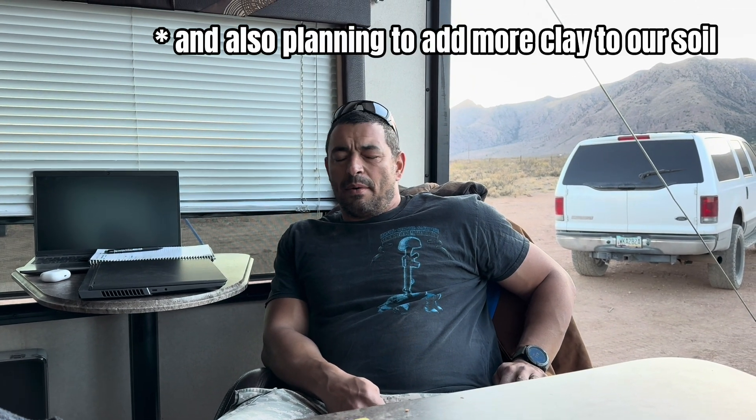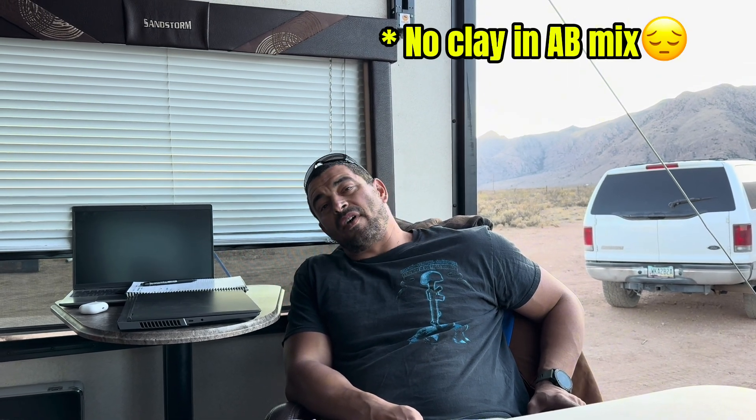Naomi is struggling because we made three or four batches pretty quick, and out of four batches maybe we got two bricks. We're trying to figure out at what point we throw in the towel with this brick machine. We're going to reach out and try AB mix, a little wetter than we did last time, because AB mix should be a decent ratio of sand, gravel, and clay. We feel we didn't have enough water last time — we were listening to the internet that said we had too much water, so we're going to try it our own way.